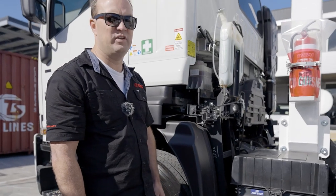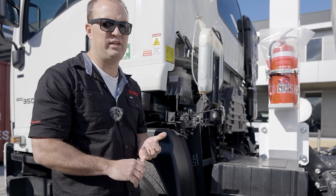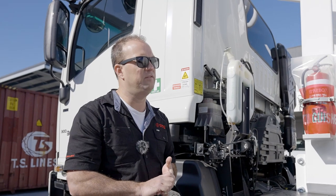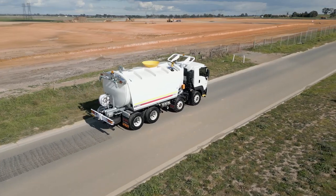So as you can see, we've just done a basic walk around the outside of the truck — just checking the vitals, checking the tyres, checking the oil levels, making sure all the bolts are secured and all your safety chains are on. It's just a really quick visual, but these are the things that are going to make you have a safe and productive workday.